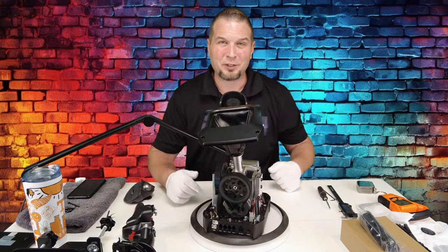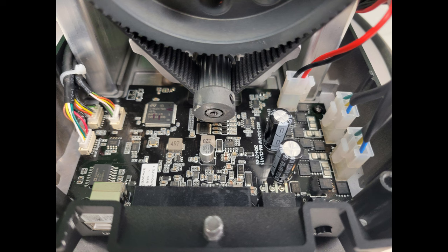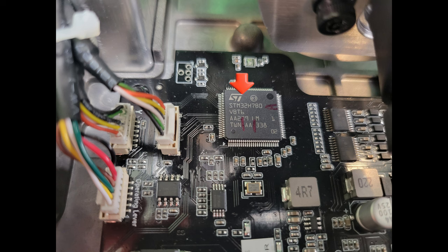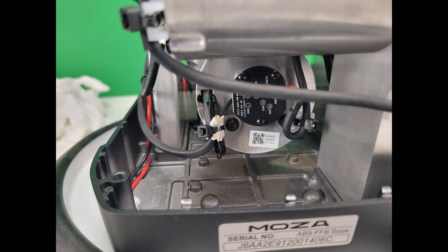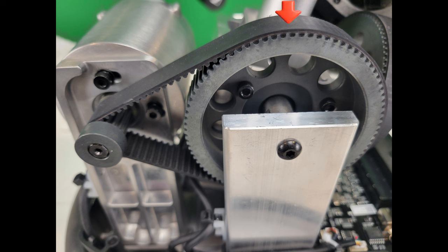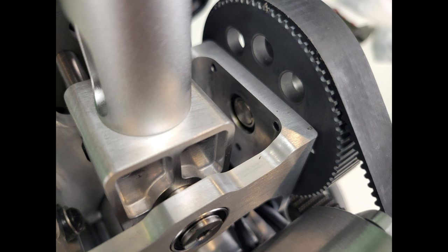We're opened up — come in for a closer look. What we're looking at here is the front of the unit. This top pulley is going to control the roll axis and is connected to the motor pulley below via a cog belt. Here's a close-up shot of the electronics with all the motor connections on the board — they're using an STM32 chip. This is the back of the pitch axis motor and the back side of the roll axis motor. This is the right side of the base — the pulley here is going to control the pitch axis.